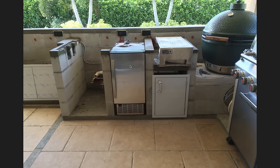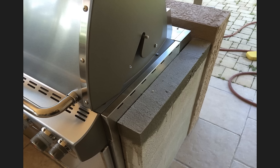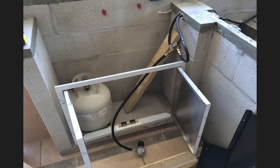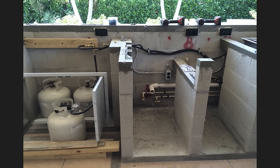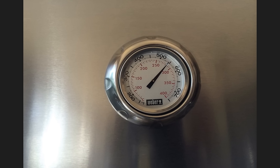I'm continuing to position doors and appliances, fitting everything together and making sure it's all good. This is how tight I got everything — it really looks professional, really tight fit gas fittings. Here's how I ran the gas over, and I ended up filling these with foam so there's no gas leaking back and forth between the cabinets. Here I'm testing the gas lines, making sure that I have enough gas volume to put everything on high. I consulted a gas company for the diameter of the tube and that proved to be really smart — I can blast everything. I can turn every burner on high and I have plenty of gas volume.